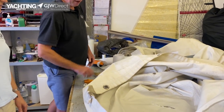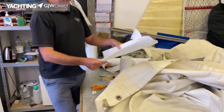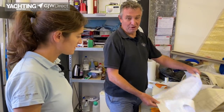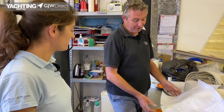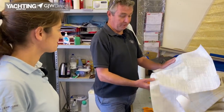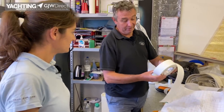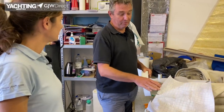In terms of repairing a tear, really what you're looking for is this material here. It's basically what we refer to as PSA — it's a sail number material. You can go into a chandler and buy those little boxes of sail repair tape, but they're pretty useless. If you go to any local sail maker and ask to buy a metre or two of sail number material, you can get it in one-and-a-half-metre wide rolls, or in various widths — like this 50-millimetre wide roll that comes pre-slit. It's not horrifically expensive to have a roll of that sitting in your locker, and you can repair most things.